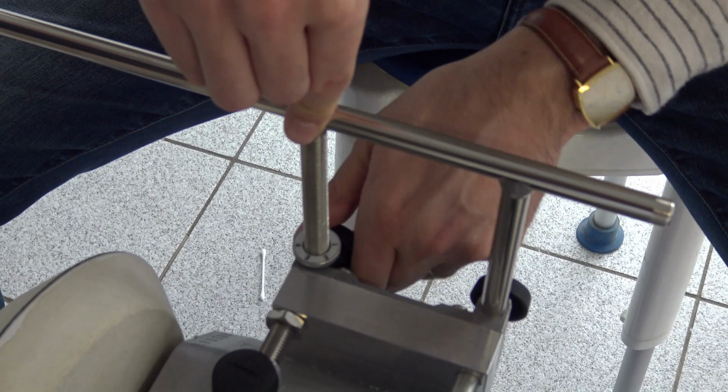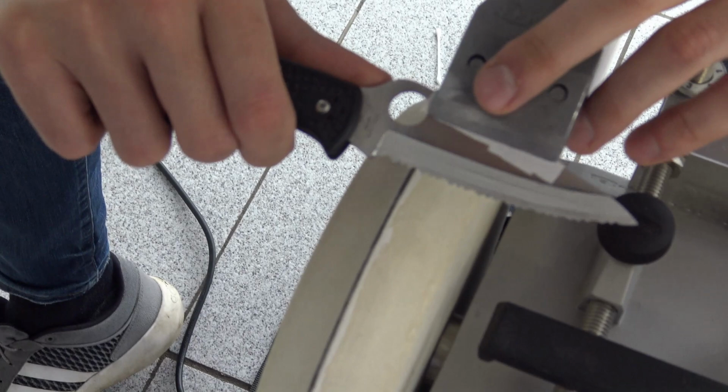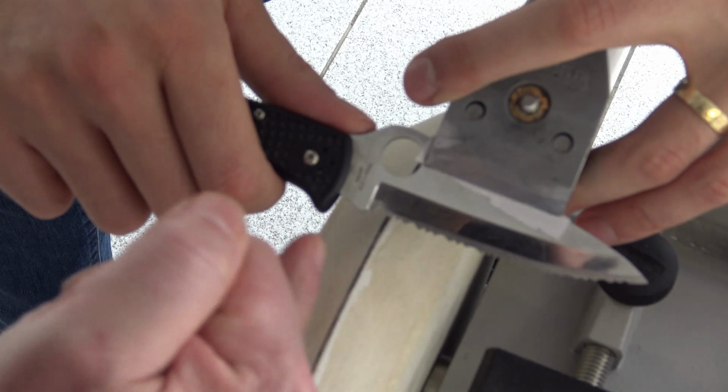Now please do it very lightly and quickly. Do not overhone. Do every valley. But not the little ones. I wouldn't bother about the little ones at the moment. Just the big ones. No pressure. Don't do it reciprocally many times. Do it one time, next valley one time, next valley one time.